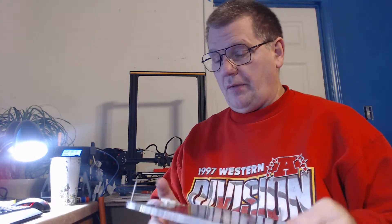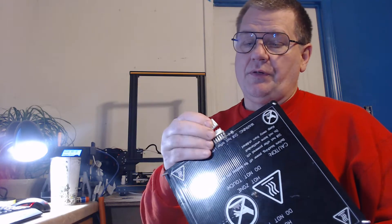One of the common problems, if you don't have an Anet yet or many of us have run into, is a problem with this plug that plugs in right here. It has a problem with melting right here. Obviously one doesn't have any wires in it, but that one has a problem with melting.